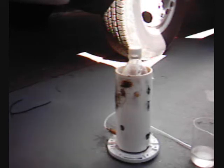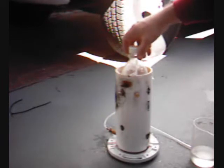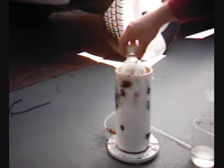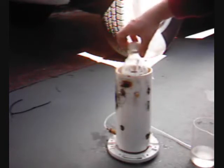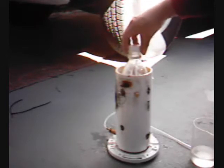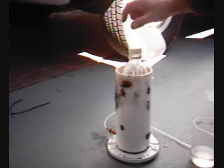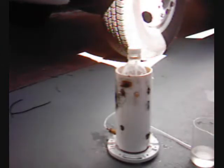I'm back. I've got this hooked up now and gas is flowing through here. I've got the top loose. This is a one liter bottle. I filled it up to where it starts at 0.1 on the bottle and I've marked the increments. When I tighten this top down, the bottle will begin to float up as it fills up with gas, and we'll measure volume.